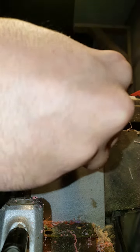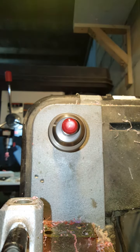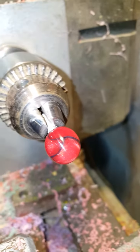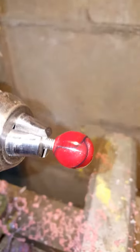That should do it. What you see is what you get — there is a knob on a 10-32 arbor. There's just a little bit of chatter right there, but I can live with that for what it's going to be. It's sparkly, glittery, and beautiful, and that took me nine minutes — part of that was because I had to look for a tool that had rolled under the lathe. There you go, that's all it takes.